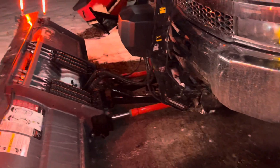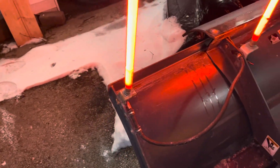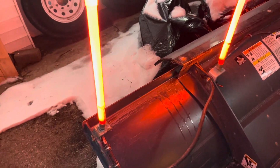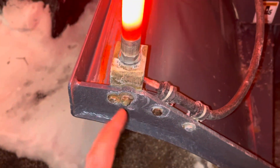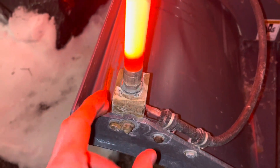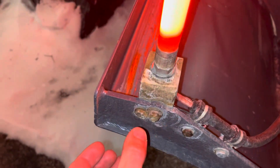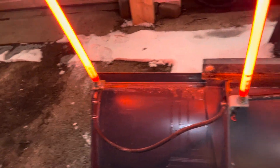These markers will work on any fleet flex truck because of the way I wired it — there are no extra connectors, still only the two plugs. If I loan this plow to someone else or put it on a different truck in the fleet, the markers will still work. You'll definitely want to make sure that if you're doing a marker on the outer edge, you have at least two fasteners, because with one fastener it'll tend to rotate and inevitably fall in, and your deflector will mow one of them off.